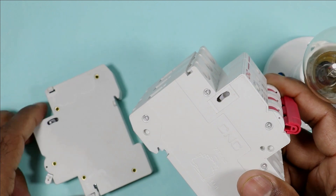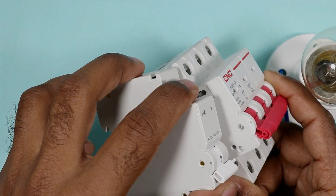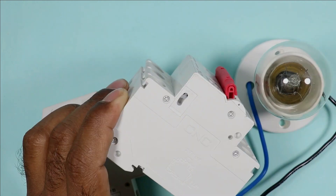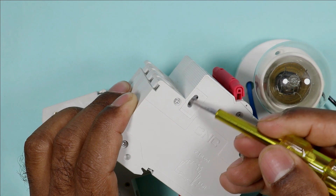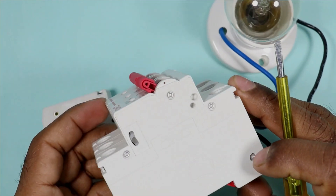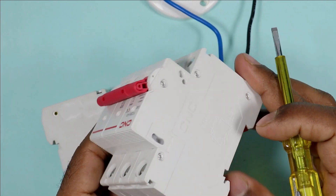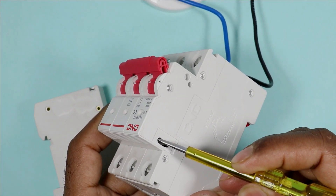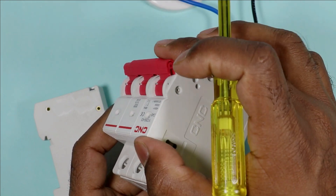So I am going to mount the coil here. After mechanical interlocking, if you turn on the MCB and try to push this knob downwards, you will see the MCB will trip. I am trying to show you more clearly — I am pushing this knob downwards so that the MCB trips. You just saw that when I pushed the knob, the MCB got tripped.